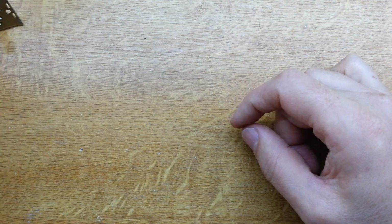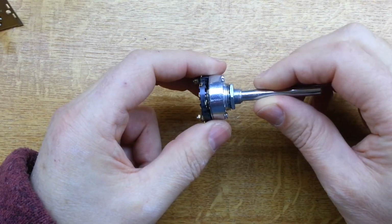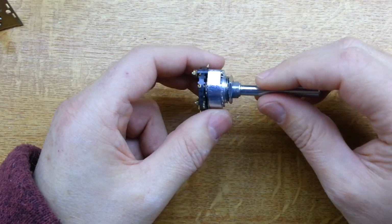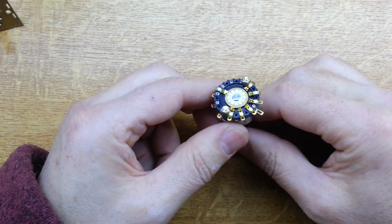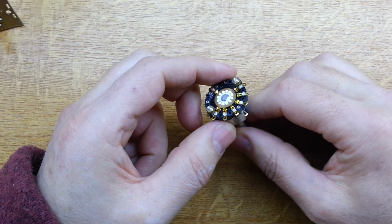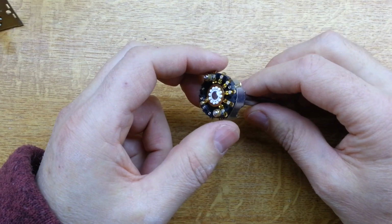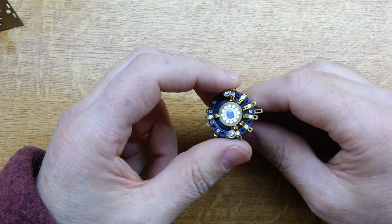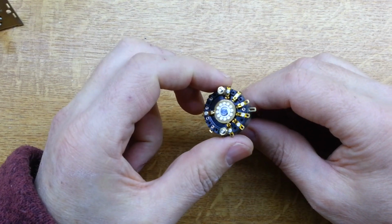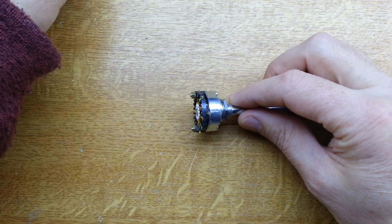I have received some parts for this amplifier, and I bought this switch here, which is a decent quality switch, and I spent 17–18 pounds on this guy. But what I realise as well is that this has also got the contacts exposed, and it's just going to have a similar issue over time. It'll be in the data sheet what the life expectancy of this thing is, but I'm just a bit hesitant to use this given the exposed contacts.